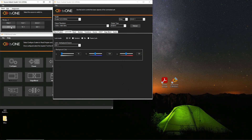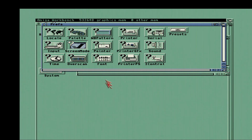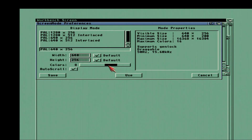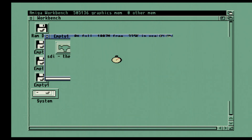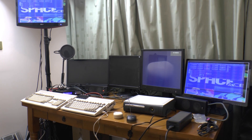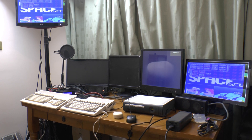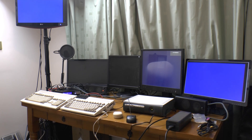So what's it like input-wise? Well, for the most part it's pretty good. De-interlacing is brilliant. I've run both Amigas through the VGA input, and even interlaced modes are rock solid. Although switching between interlaced and non-interlaced modes might need a tweak to arrange the frames properly, and that seems to be a front panel only job. It doesn't like you changing resolutions though — you end up having to readjust the screen size manually. The unit allows you to store a number of different preset system settings and switch between them, but these don't seem to be included. That might just be a quirk of dealing with the weird video settings the Amiga tends to kick out. Stick with one screen mode and, as an upscaler for video capture or better monitor support, it's spot on. I'm not sure what's causing that blue tint by the way — it seemed to come and go and now it seems to be stuck in there, but notice in this particular resolution it's only affecting part of the screen.